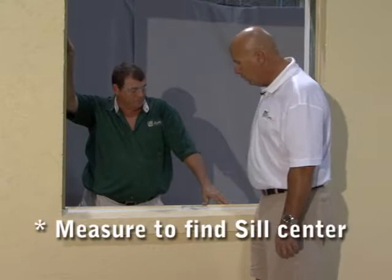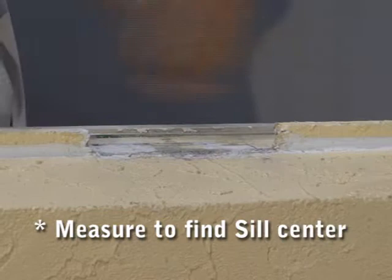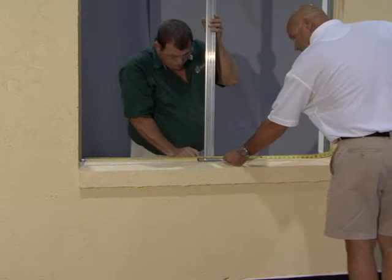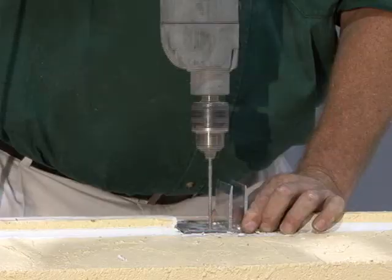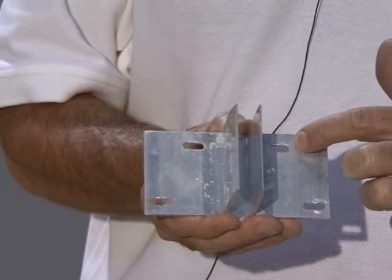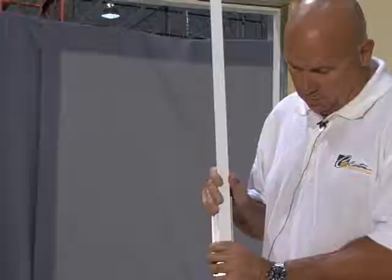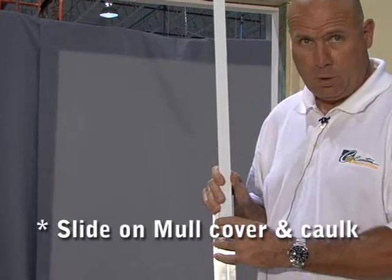Now the new three inch buck is installed and caulked in place. You measure the opening width to find the center of the opening where your mull goes. You knock out the lip on the precast sill and then pre-drill your mull clips. To pre-drill the mull clips, measure and position the mull clips over the center of the sill. Mark the holes, then pre-drill. When drilling holes in the sill and in the head to install your mull clips, use the center of the slot so you can adjust the clip back and forth to get your window in the opening.